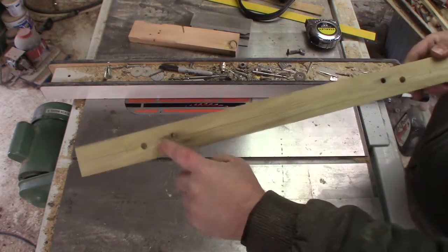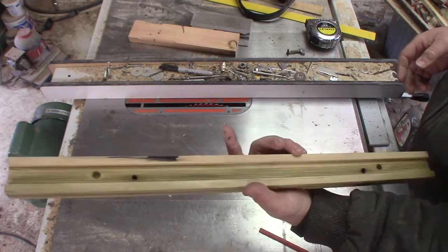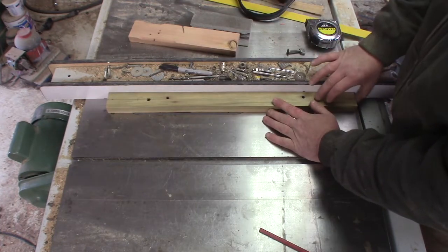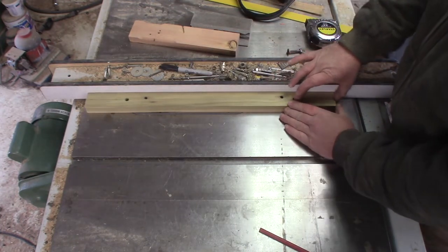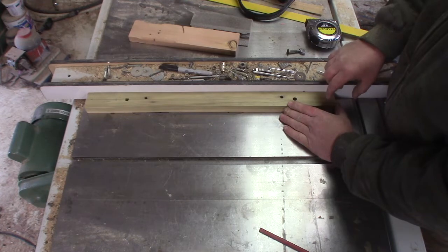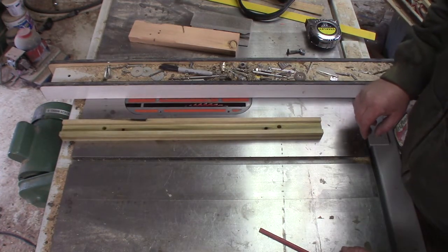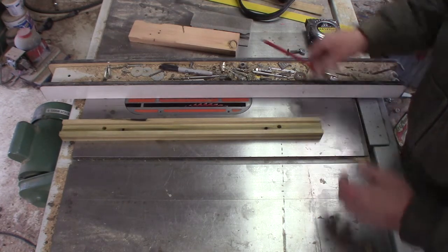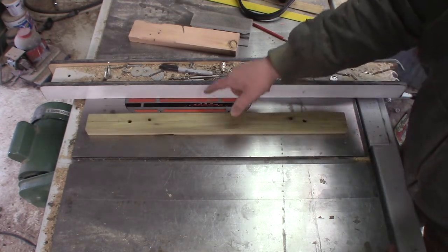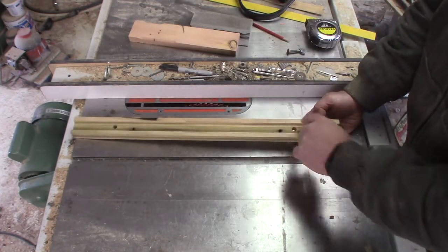There are my stop cuts. Now I'm going to do something — it's probably not in your table saw manual. I'm going to plunge through and then move this forward and back until I get to my holes. I don't know how dangerous it actually is; it's probably going to be just fine. Just be aware of kickback, keep your fingers clear, and you'll have to run your blade all the way up in order to not end up with too much cut on this side.